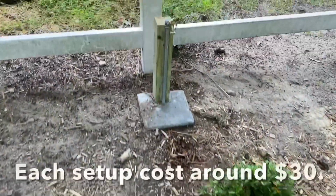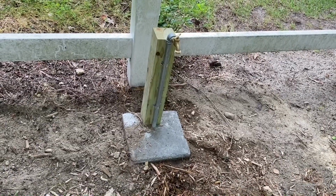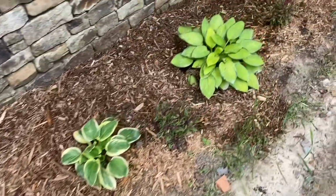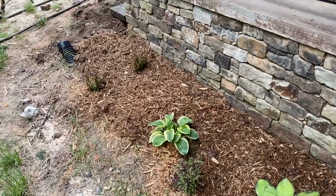Okay, so to sum up, in a weekend and a half, I installed one faucet for the front yard and the flower beds up here, ran the pipe down the property line, and at the other end of the line I have another spigot in the back north corner of the yard. And for watering things closer to the house on the back side, instead of a 75-foot hose, we have our third spigot. And after mulching, the flower bed looks almost as good as new. So that was today's job.